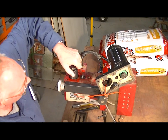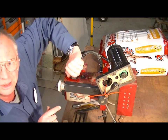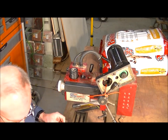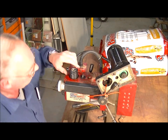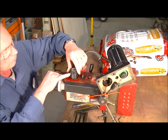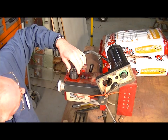At high speed you can hear it go clonk clonk — so the gears have stripped in there as well. The next thing to do is take this collar off here. There's a little allen grub screw that you have to undo — it locks it onto the thread — so we'll get that undone.